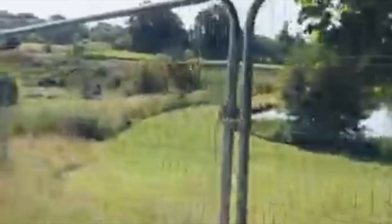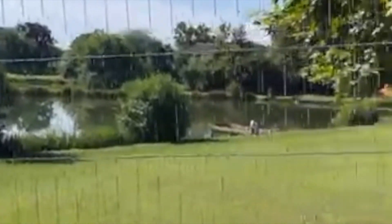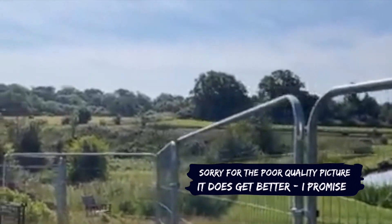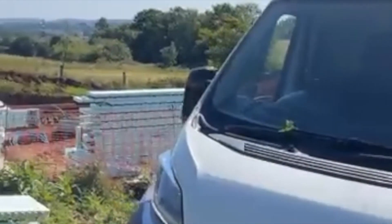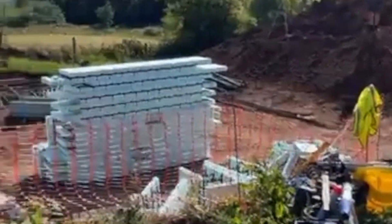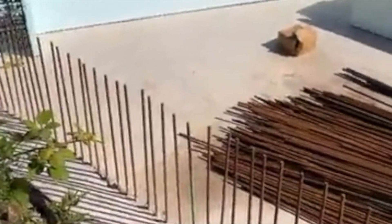The site we're working on is a fisheries — a fishing farm basically — so absolutely fantastic setting. Obviously it doesn't look too great with the Heras fencing up, but you get the picture. We've just unloaded all the ICF and got all the bits and pieces out. The groundwork's all been done before we started — another firm did the groundwork, putting in a raft foundation slab. You can see all the steel rebar there which we're going to slot onto.